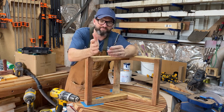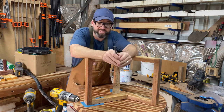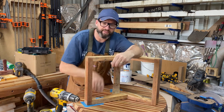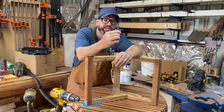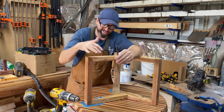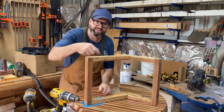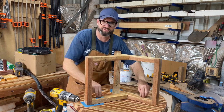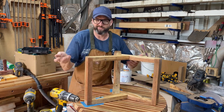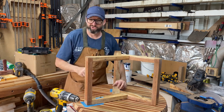In the past, I've been guilty where it's just not right, and for whatever reason, the holes never line up perfectly. So these are an 8mm bolt. So I've got a 10.5mm hole for that to slot through to allow for a little bit of movement if needed. And that gives enough play as well to make sure those little bolts line up in the threaded inserts nicely. So I find that routine this time has worked pretty cool. But anyway, trial and error.